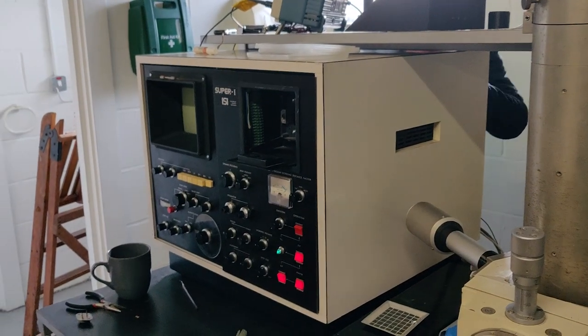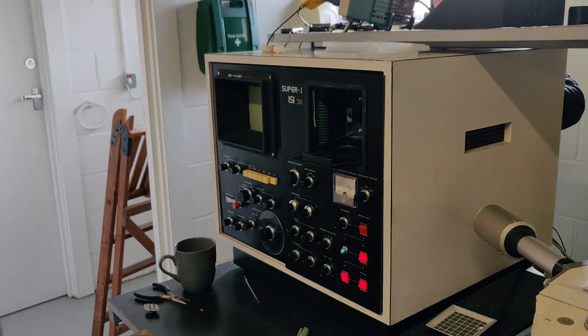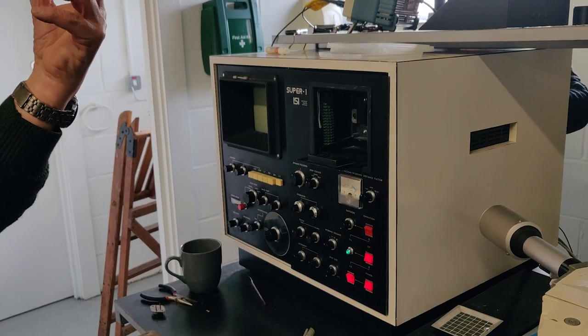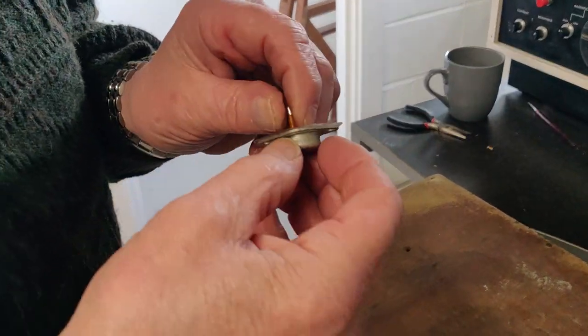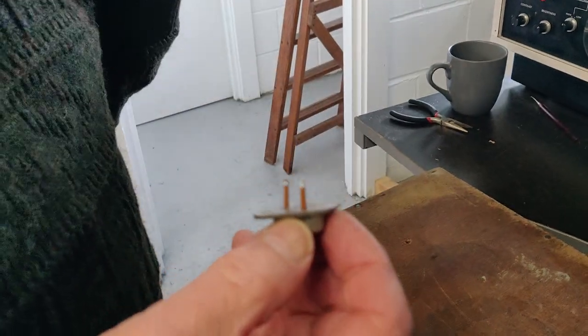Power out and put the coax in. Yeah. Why are we putting the coax in? Because otherwise we've got a high voltage floating around the end of it, it will arc over. Yeah, okay. Okay, so that's our culprit. Yeah, now we've got to put the other one in.